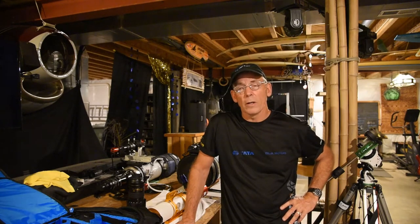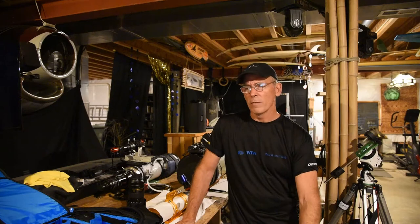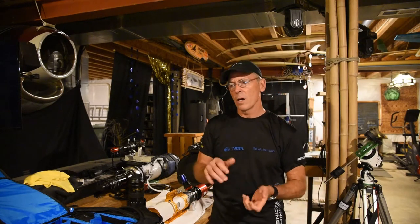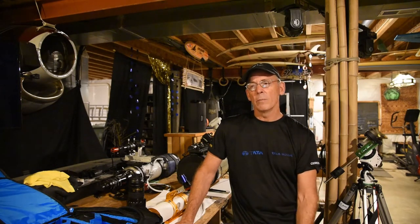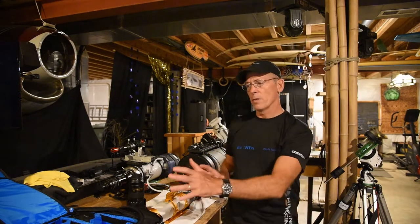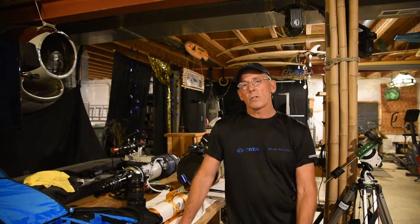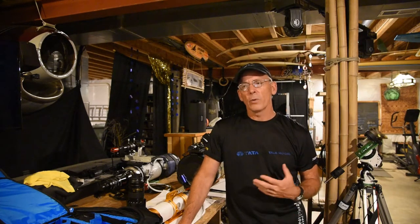I didn't know enough, but it did work, and I would say it wasn't a whole lot worse than some of the telescopes you would buy in a store. So that was really cool. It's actually an accomplishment. I did have to buy the mount for the mirror that adjusted it so you could collimate it, and the eyepiece and things like that. But grinding the mirror, I think, was the biggest challenge and the coolest part of the whole thing, because you had to build up all the test equipment. So that was cool. And then ultimately, I got into astrophotography about 3 years ago.